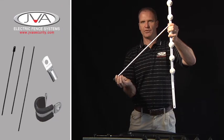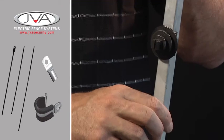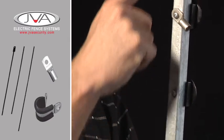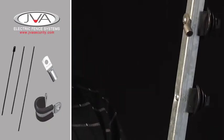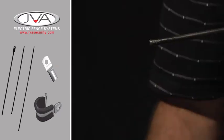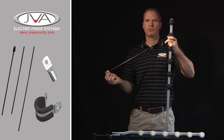And there you have your stay — any tension is put on the stay. With a square tube bracket, we already have a screw going through the back of the square tube. At the point you want, you just unscrew the insulator, put a lug on the back, and same situation — put your bracket into the back of the lug, mount it on the wall and use a second lug on the back of the stay, giving you a nice, strong support for your square tube bracket.